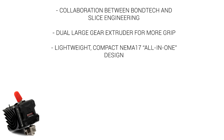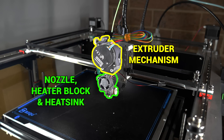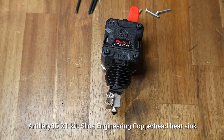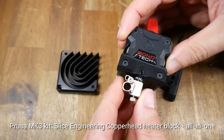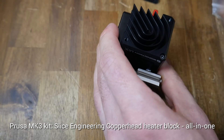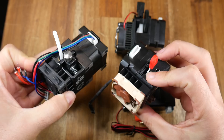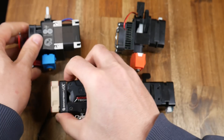Like other modern designs, this is a lightweight, compact, all-in-one concept. Traditionally 3D printers have had very separate extruders and hotends consisting of the nozzle, heater block, and most importantly a heatsink. While it's still possible to configure the LGX in this configuration, as seen on the X1 kit, it's also possible to configure it so that the hotend goes straight into the bottom of the extruder, with the heatsink mounted on the side for cooling. This is keeping in line with what we see from the E3D Hemera, as well as the BigTreeTech H2, which I'll be covering in future.